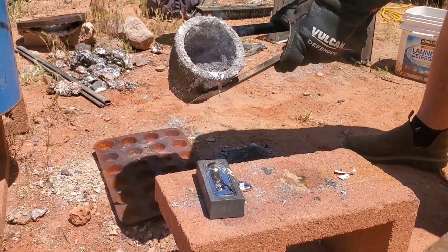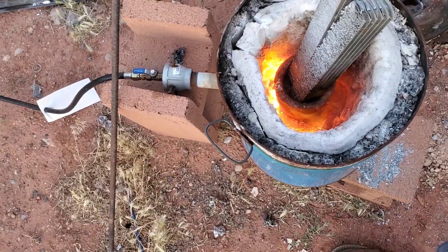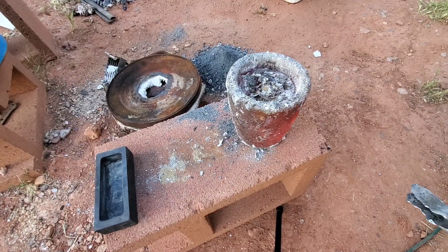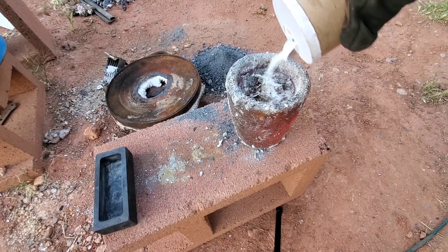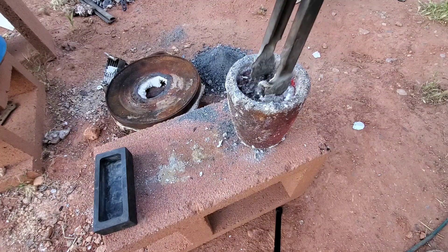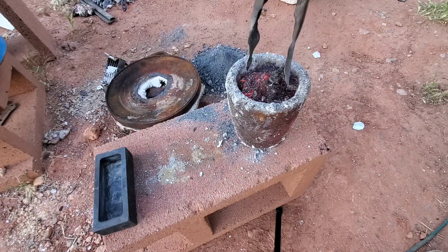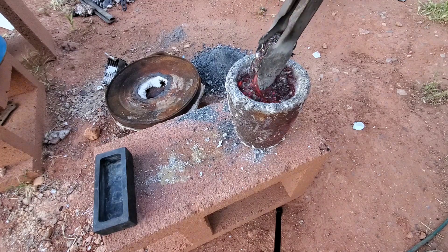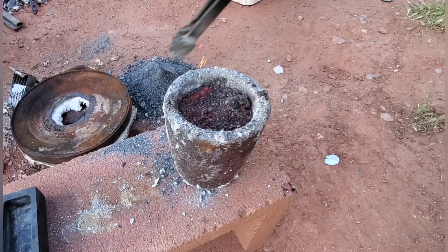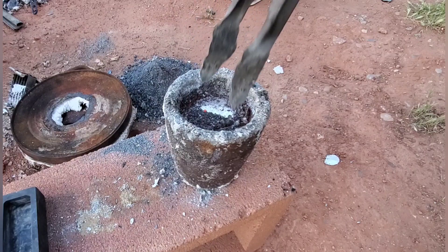Good thing there was a lot of aluminum in this radiator — gives me lots of stuff to work with. So this is where I was talking about the slag or dross. We're gonna put some table salt in and this is used as a flux. It helps thin out the aluminum a little bit so it doesn't stick to the waste that we want to get rid of. If you look here, there's a lot of something that was burnt — scraps, whatever — but there's not very much aluminum in it. It's pretty black and dark, so we know that we're getting good quality aluminum and we're not wasting very much.